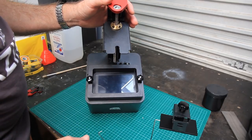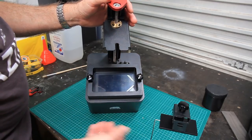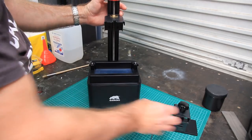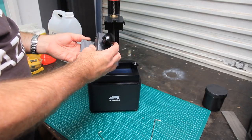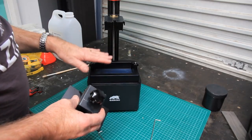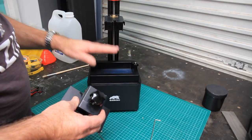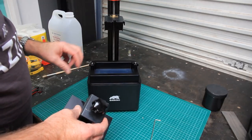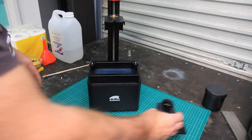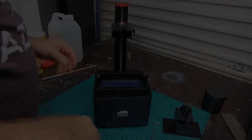And that's one of the things that you should do prior to putting resin into your machine, prior to doing your first print. You really should leave the build plate off, set a print running, and check to see that your screen is working properly so that you're getting a nice crisp clean image on the LCD screen, and then you'll know that the machine's operating correctly. All right, so